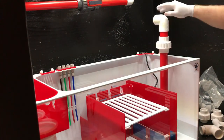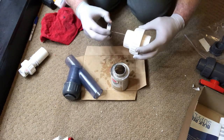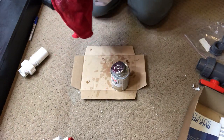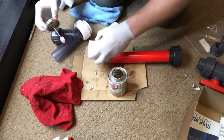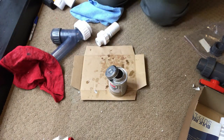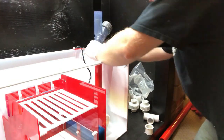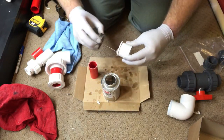I did it this way because I wanted to know the height that I was going to have it and then where to bring the pipe from the returns down to the return pump. Now we're installing that Y check valve — definitely an investment, expensive but worth it. Check valves are a good thing — if you lose power and you have a sump, you don't want overflow to happen. The benefit of having this check valve is with it being a Y, you can clean it without cutting it off your main pipe. I got it from Bulk Reef Supply, but I felt it was an investment worth every dollar because I didn't want to have to keep cutting and re-gluing when I had to clean check valves. You will need to clean them.